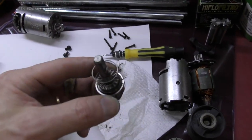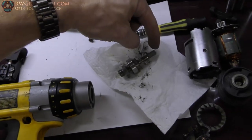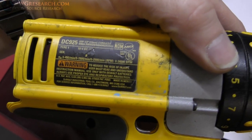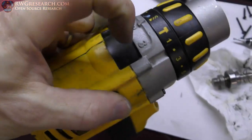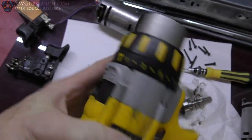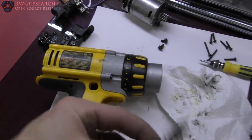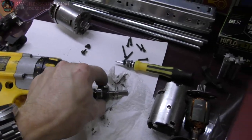The clutch mechanism is pretty cool — learned how that worked. It basically pushes on there and slides the whole thing out of the gearbox, depending on how far it's set. The gearbox has a ratio of 450 RPM, 1500 RPM, or 2000 RPM. Closer to the three is more of a one-to-one direct drive; more toward the one gives you less. So now I have the ability to change the gear ratio within those parameters. The part that goes into the gearbox has a two-sided flat side.